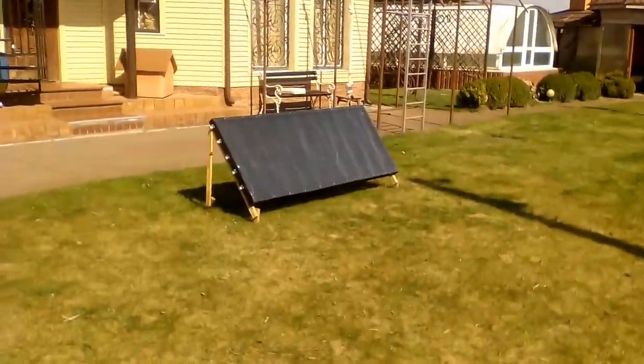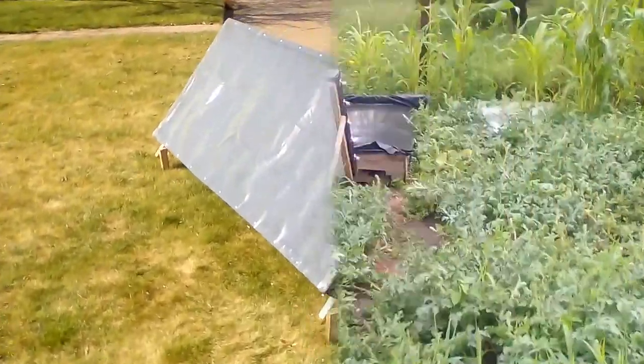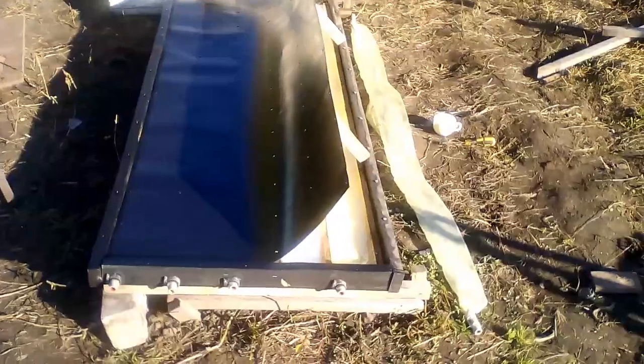Let's look at the results of this testing when my solar collector had this position for two months under transparent polyethylene film, without water circulation, but its sleeves were filled with water. Then the collector had another position for four more months, and its sleeves were filled with water too. The collector was in stagnation temperature between 90 and 100 degrees Celsius several dozen times, and after that I decided to take a look at its condition. Four of the five polymer sleeves were in good condition, but this sleeve had a hole, and if you understand the causes of this hole, you can describe them in the comments. These sleeves are made of 100 micron low density polyethylene, and I recommend an increase in the thickness of the polymer and use of high density polyethylene or other heat-resistant polymer.